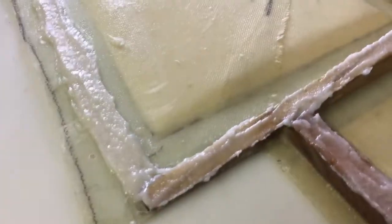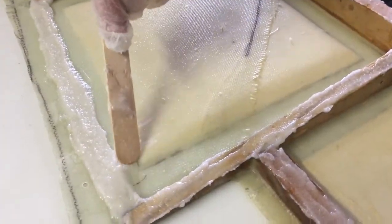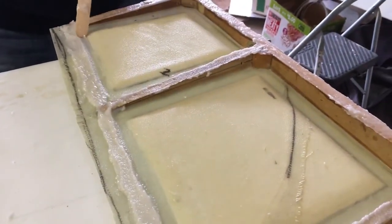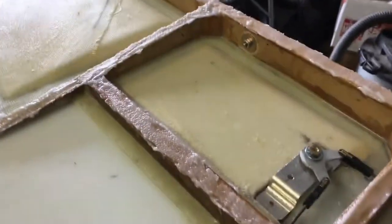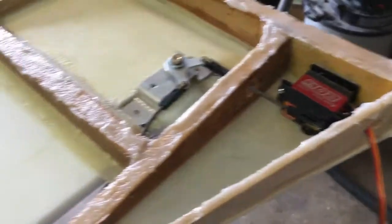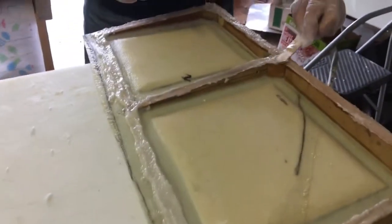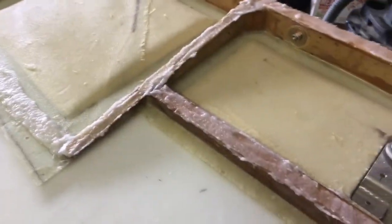You can see the sandwich foam in three layers of glass. This elevator construction does not sandwich in a bunch of foam — we just use a quarter inch foam, lined it out, and layered it in a manner that we have more glass than foam. But when we sandwich these structures together, they are very, very strong and very tough.